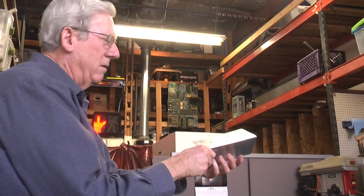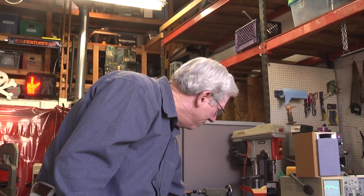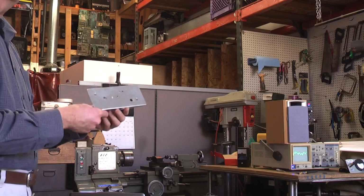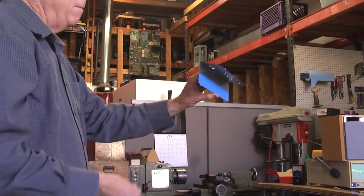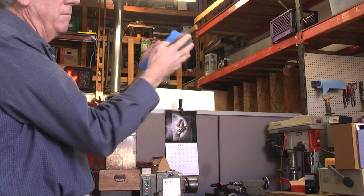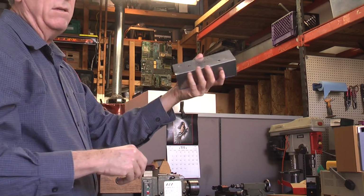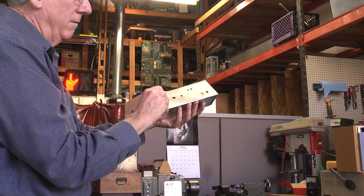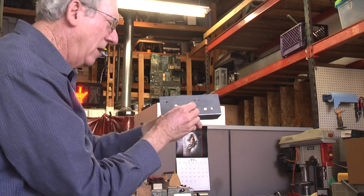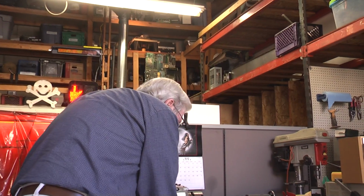Here's a trick that's unique to me. This is how I put together electrical projects. Because the cabinet can easily cost more than all the other parts put together, I buy this. It's called flashing. It's normally just 90 degrees, and I bent it a little further after poking the holes in it. It's so cheap, less than a dollar, that you can make a trial run, just put the holes anywhere, and then you see, oh yeah, this hole needs to be over this way. A very, very handy trick to use.